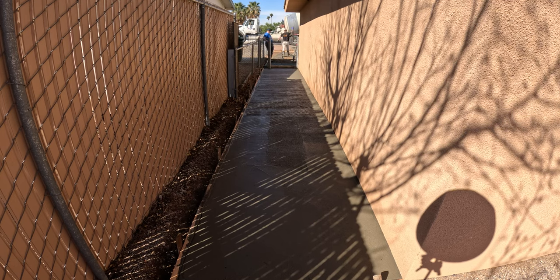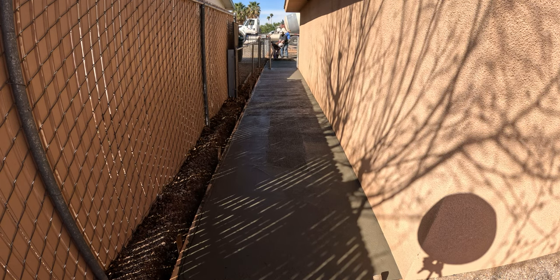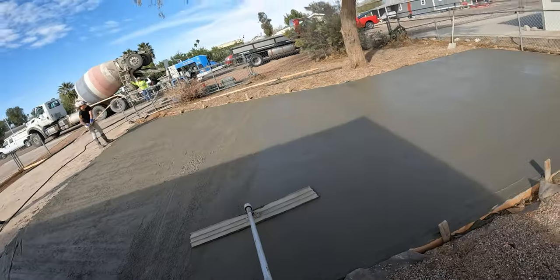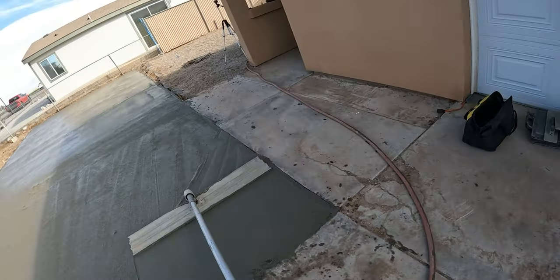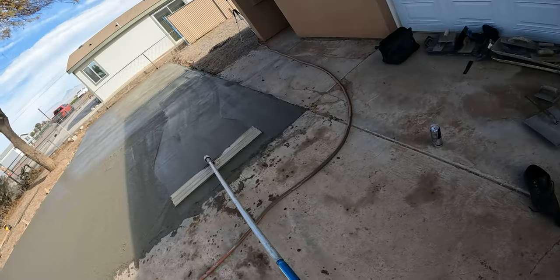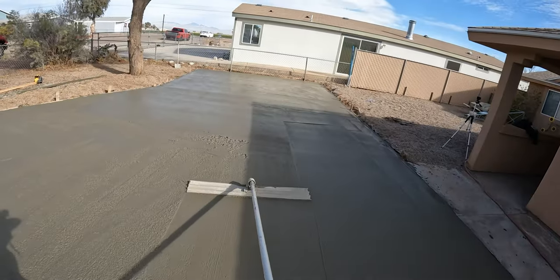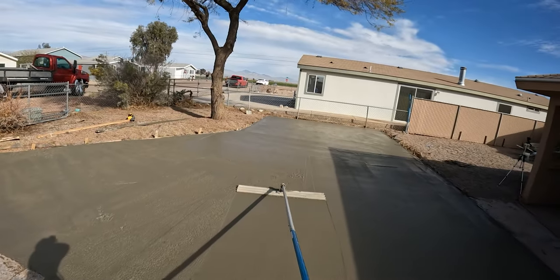Here's a four-foot walkway coming out. I didn't put any steel in this side yard — it's just foot traffic so it doesn't really call for it. We're just going to put a lot of joints in there and call it a day. This is all getting a non-slip broom texture and I'm going to use the horsehair broom on it. I used the nylon the other day and really didn't care for the texture, so I went back to horsehair. It seems like every time I give nylon a try, the horsehair always wins.